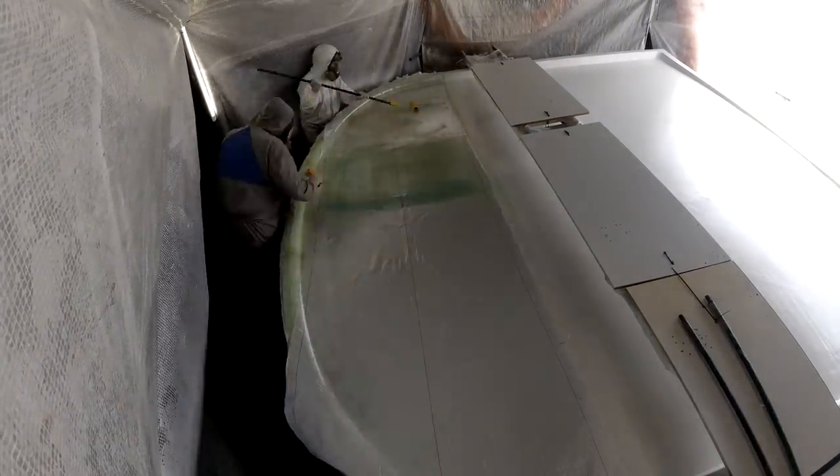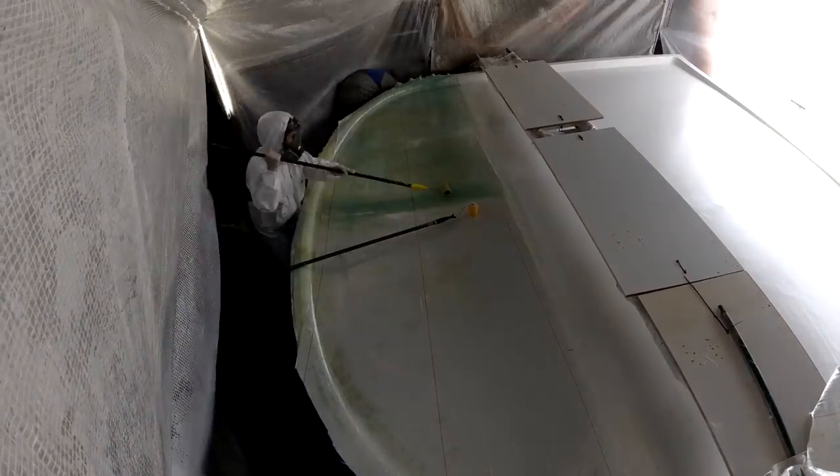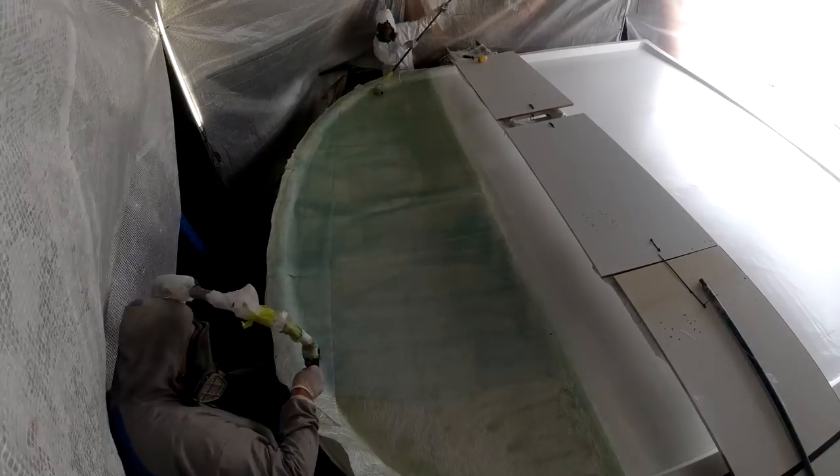and often I'll invariably check this with a mil gauge, which is a small metal device that will check the gel coat as we lay out the gel coat. Experience certainly counts, but runs on the surface can be lightly sanded when the gel coat cures prior to laminating, so it's not as essential as a paint job.